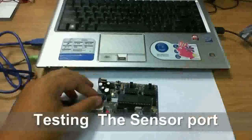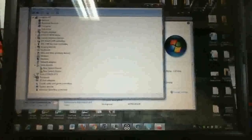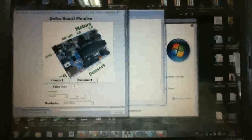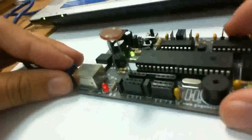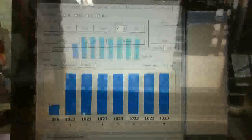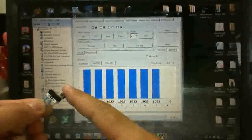Once you've soldered everything, the testing process requires you to connect to a computer, turn it on, and connect to the GoGo board using the GoGo Monitor software. To connect to the GoGo board, you first need to know which serial port or COM port your computer sees the GoGo board as — you can see that in the device manager. Once you've connected, you can put in a simple sensor such as a light sensor, and click burst on. You should see a set of bars on the screen, and if you apply light to the sensor, you will see a change in the sensor readings, indicating that your sensor is working. This is another test using a switch — if you press the switch, you should see changes in your sensor readings.